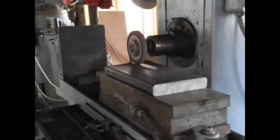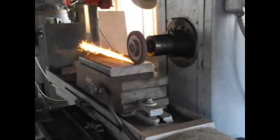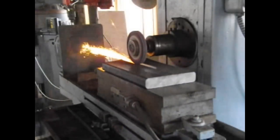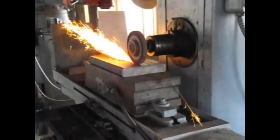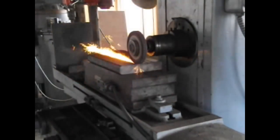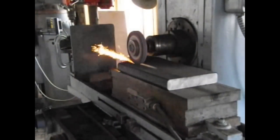Once you get the height, make horizontal passes across the material. When moving the material left and right, watch your speed to reduce wear — better slower than faster until you develop a feed-rate intuition. When moving the material back and forth, try to move the grinding wheel a distance just under its width in order to prevent uneven wear. Depending on the unevenness of your material, you may have to make multiple surface passes at lower and lower heights. Make sure that you surface grind the entire surface at a given height before lowering the grinding wheel more.